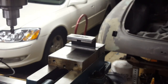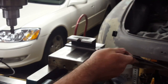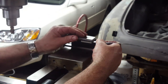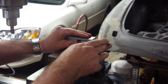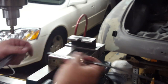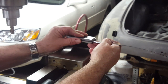Here's where we're at. I just trued this part up in the shaper over there, got the edge nice and true. The idea is that you take your bandsaw blade and lay it in here like this, then take this piece of metal — we're going to put two threaded holes down into this part, just a couple of quarter-20 screws here and here, and it'll clamp the blade down in place. I'm going to mill a slot in here so that we can weld through it from underneath. That's why I only machined 20 thousandths down — the blade is 25 thousandths thick, so this will hold it and clamp it in place so we can do our weld. I'm just trying to keep this as simple as possible.